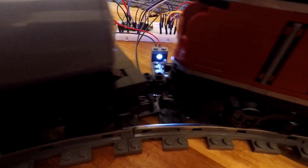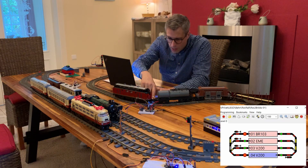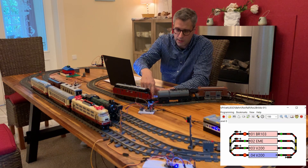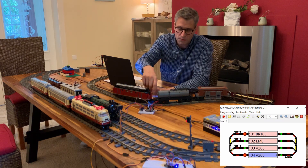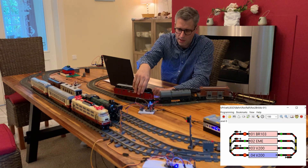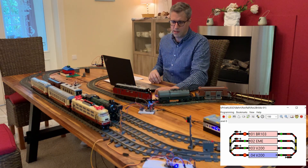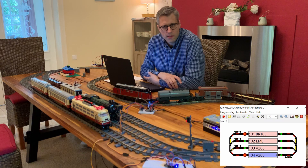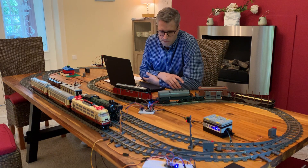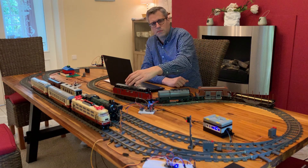But what we can do is go a little bit further, and when we are in the area of the coupling magnet of the loco and the first wagon, this will actually trigger the sensor. That is working. So here we have a really nice option that you can also use if you don't want to integrate some additional magnets into your trains — just use the coupling magnet.